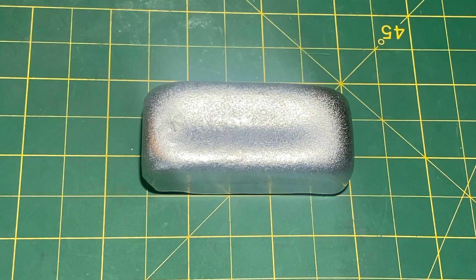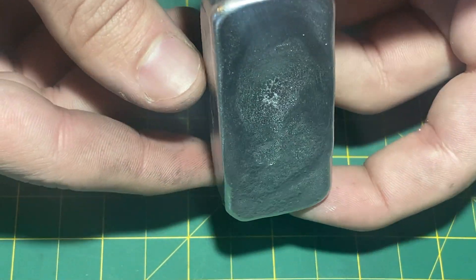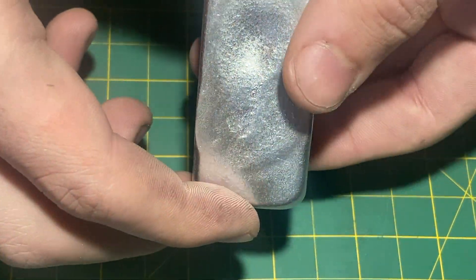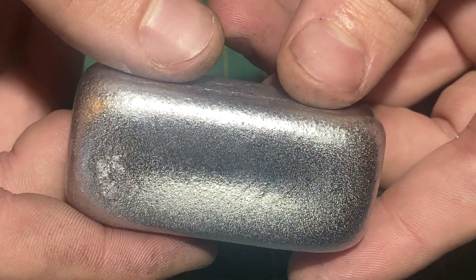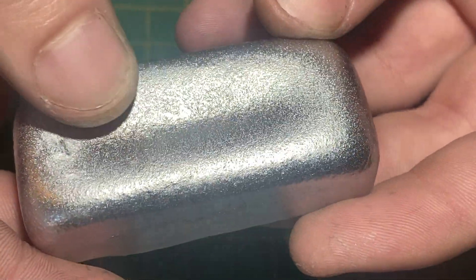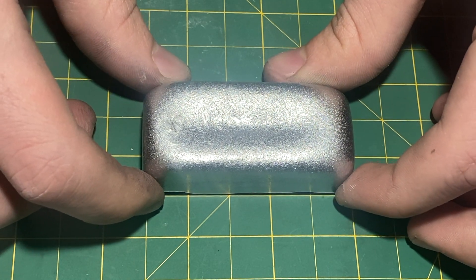It looks pretty good. Here is the ingot after the quench. It looks pretty similar to the ingots I've produced in the past. I still have yet to figure out why I can't get a sharp 90-degree edge all the way around, even though everything else has a nice radius. In general this looks really good. The surface finish is alright, a few little bubbles — you can see them forming in the pour footage. The sides look pretty nice, and the bottom has that characteristic little divot. Overall it's a nice little ingot.